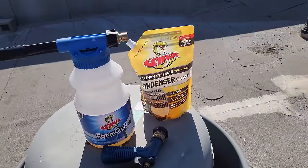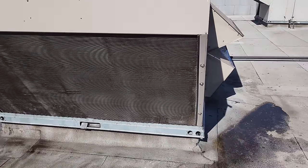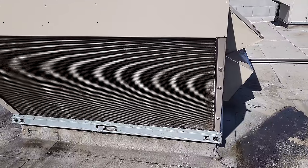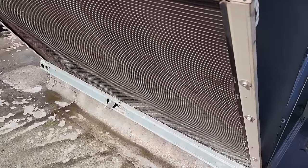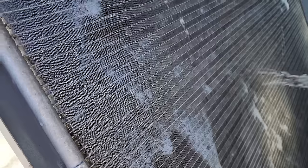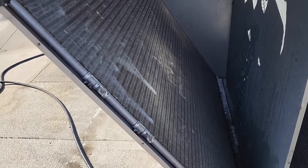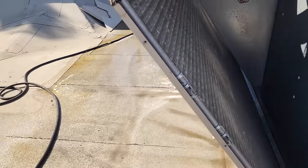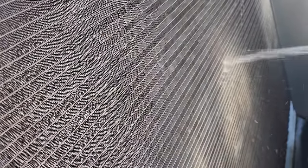This is safe for the aluminum — just let it sit five to ten minutes, then rinse it off. Sometimes you have to do another rinse. With micro channel, you have to be careful because if you use the blue cleaners it can etch the coil, damage it, and cause refrigerant leaks. I did a pre-soak of the outside of the condenser with the cleaner, then pre-soaked the inside. You want to use low concentration on these because the soap really gets stuck in micro channel coils. We'll let it sit, then give it a good rinse. The water pressure is very annoying.